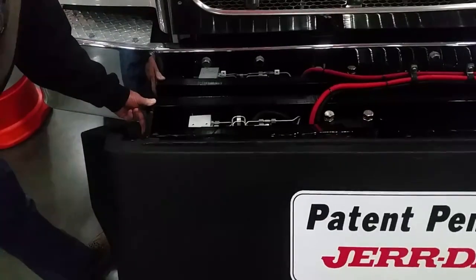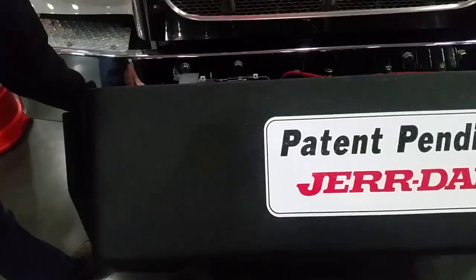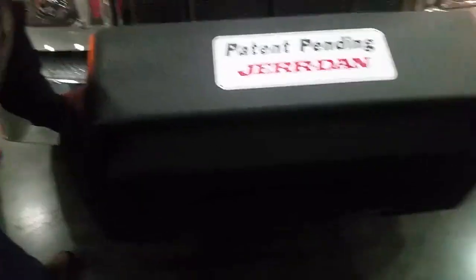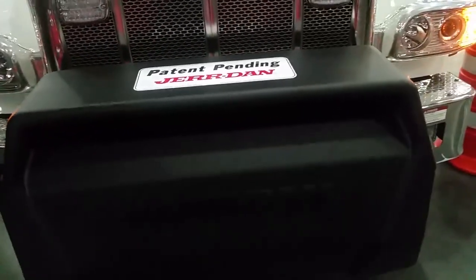On this particular unit, it is a 20,000 pound rated front axle. The unit here with the 3,500 has put 19,000 pounds on our front axle. The equation always, when an underlift is worked, every time it extends out one foot, we're taking 1,000 pounds off our front axle.